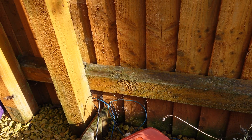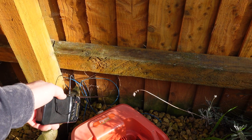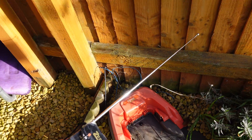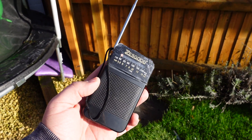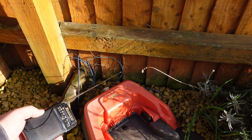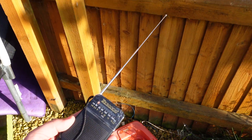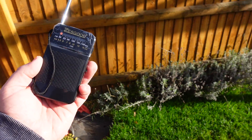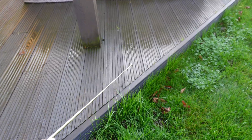You can hear the noise, and if I move the radio near the cable you'll hear a change in tone. It gets static-y — you get electrical interference as you go closer. You get that interference again and again. If we come into another part of the garden, it's very strong here because that's the source of electricity. You can move around the garden — I know the boundary wire is a few centimetres away right here.